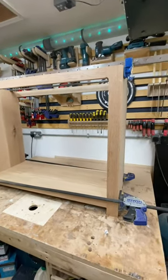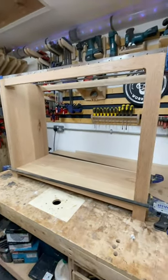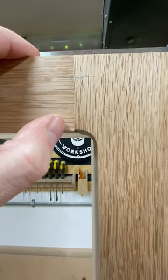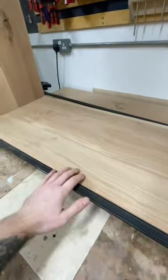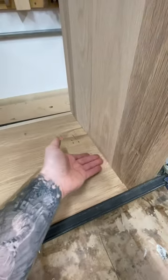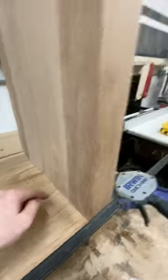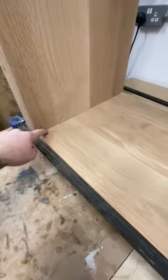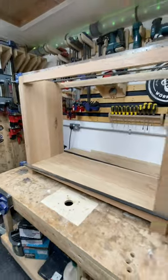This is where we are at. These are all in. Well, I say in, they're just clamped in place right now. There's no dominoes holding them in or anything. And I still have to cut them to size. You can see there, it's a little bit deeper than where that curve fits in. So I need to take a little smidge off that. The bottom panel is also in. They're going to get dominoed into the stretchers here. It also goes underneath here to close that gap that's underneath, the same as on the top there. So I notched out all the little things around there up on the bandsaw. I didn't film it, because I just wanted to get it done. But you know what it is, little notch, and then it slots right in. But yeah, that's basically what it's looking like right now.